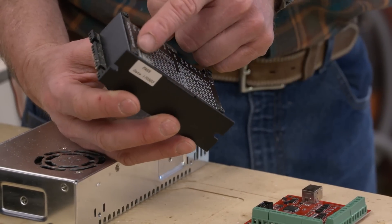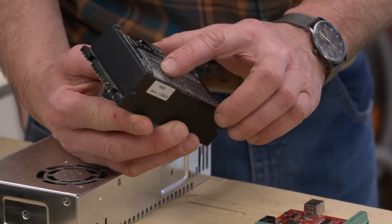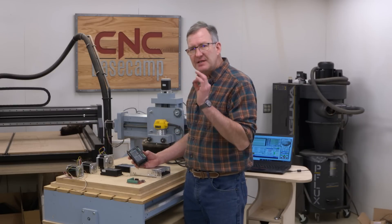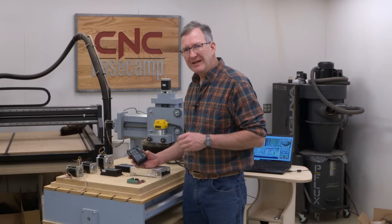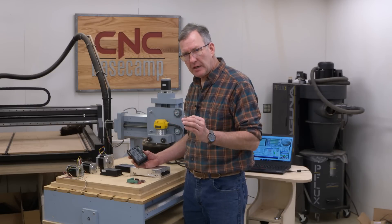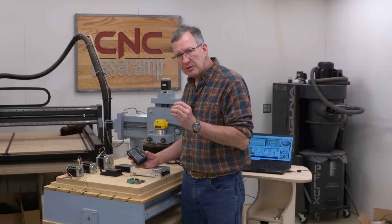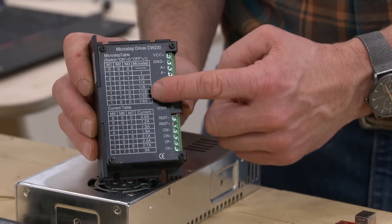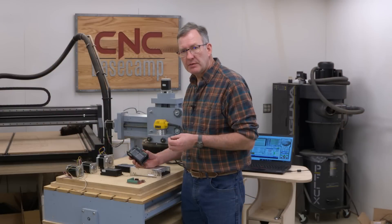When you look at the driver, you'll see two sets of information. On this one, the top set is setting the number of microsteps. Each motor is divided into 200 individual steps, so it's not rotating like a conventional fan motor — it's cogging its way through 200 individual cogs. Those individual steps can then be broken down electronically. The microsteps are set up electronically within the driver. Choices include one, half, quarter, eighth, sixteenth, thirty-second, and one sixty-fourth — that's how many times we divide each of those 200 steps within a full rotation.